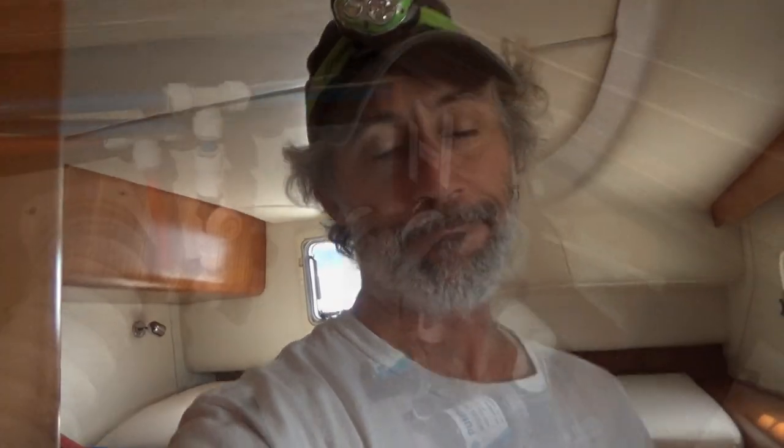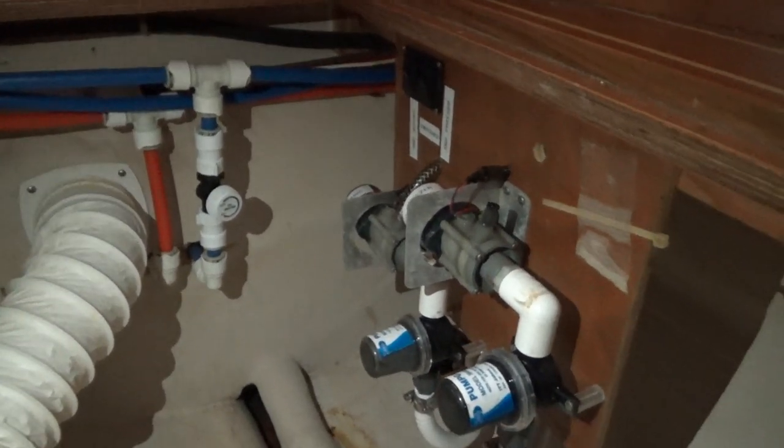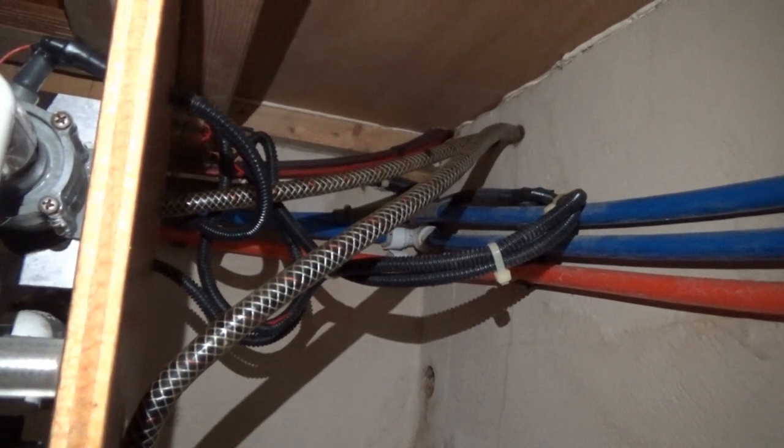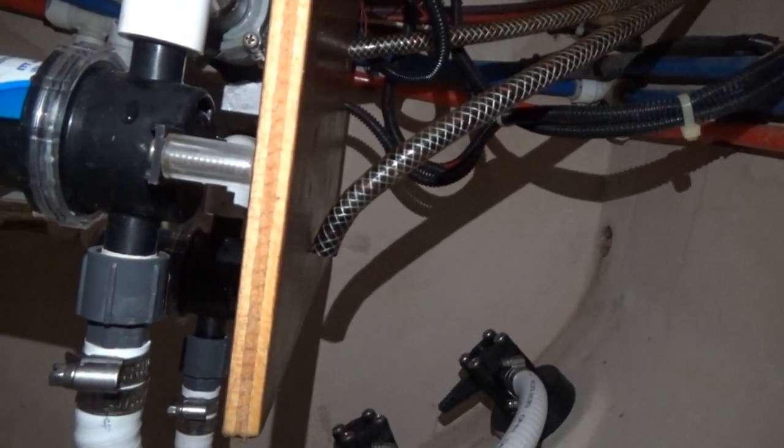Right now I'm replacing the hose. The way hoses and wiring run through boats it's kind of tight, so what I'm going to do is take the new end of my hose and use electrical tape to connect it to the old hose. If the hole was too tight I could use thread and basically stitch the hose to the old hose along with some tape to make sure it holds, but I think just the electrical tape will get me through it today. Down here in the port aft bilge of the Antares is where the pumps are for the fridge and freezer — a pump for each — and then behind it runs the hosing through a hole to the bulkhead, which runs up to the cockpit area. We're going to tape our new hose onto the end of that hose and try to pull it through.